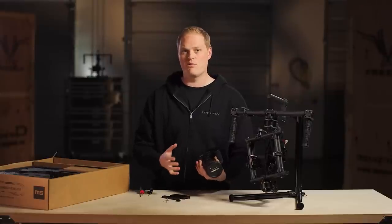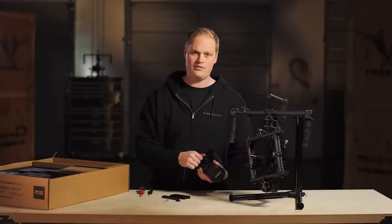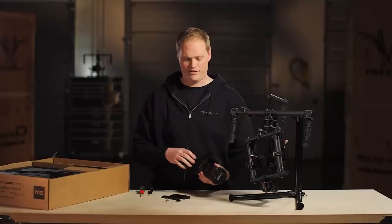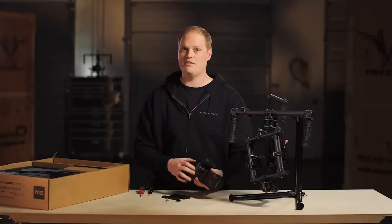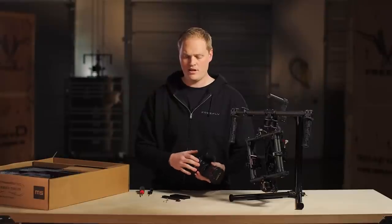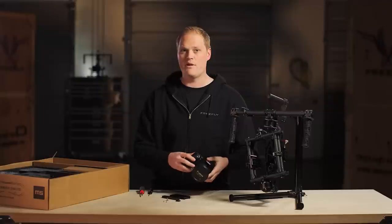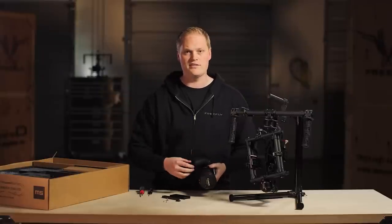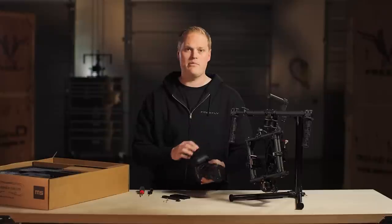The Epic has a super robust machined body. When you mount to that on one side, it basically becomes one with the gimbal and allows you to tune it up fairly easily. With smaller DSLRs, the mounting points aren't as secure. To get the performance that we wanted out of the M5, we decided to redesign the camera cage such that it mounts to both the top and the bottom.